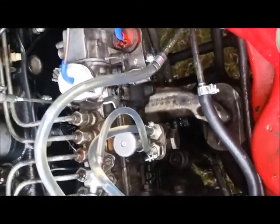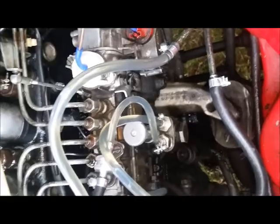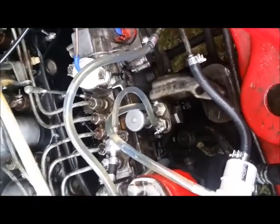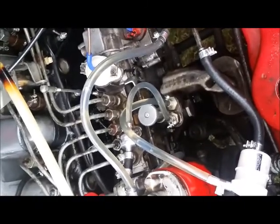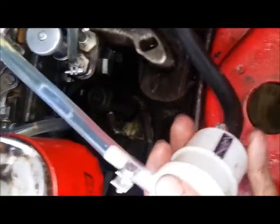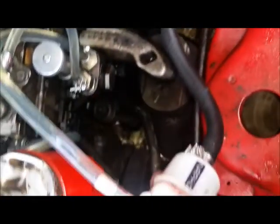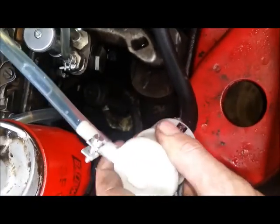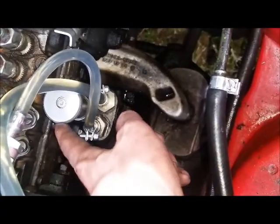Either you've cleaned out the fuel tank or run out of fuel by accident - for some reason there's no fuel in the system and you've just had to refill it. This is how a Mercedes diesel OM617 and OM616 from the W123 series works. The outlet from the tank comes here - this is your fuel source. It goes through a filter, which is slightly larger than normal here. You have a sacrificial filter which protects the lift pump. The lift pump pulls fuel all the way from the tank up to the engine bay.